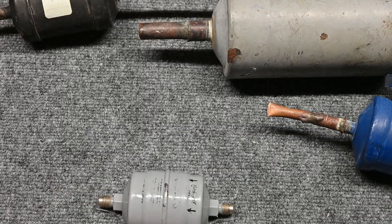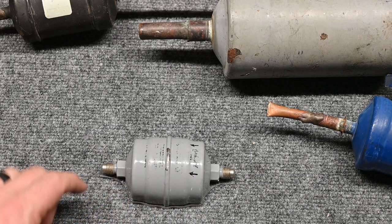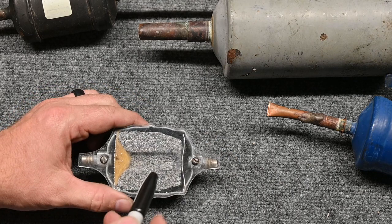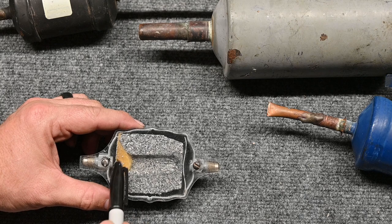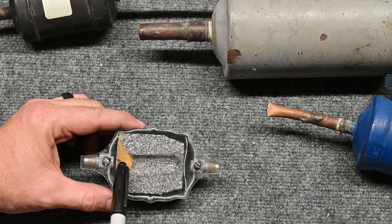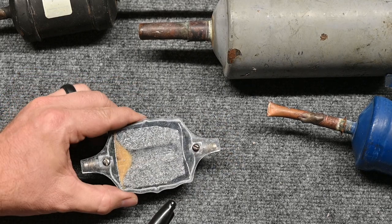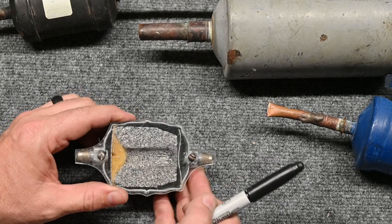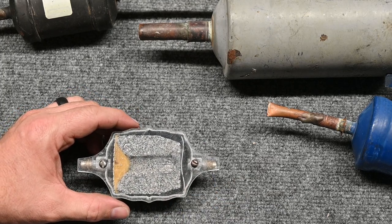It doesn't hurt to refresh — it's important to understand the direction of the refrigerant flow. So our arrows are flowing in this direction. If we see that our filter is built with this little groove cut in the center, and we have our filter material here, the idea is we go through this desiccant and then through the filter material. So if the desiccant comes loose — and you can see if we shake this — there's little bits of that desiccant floating around in there. This filter catches it before it goes through the system.